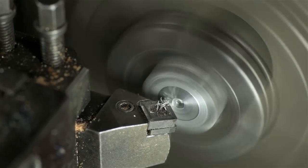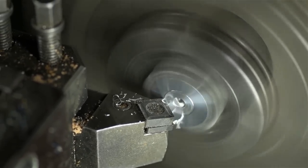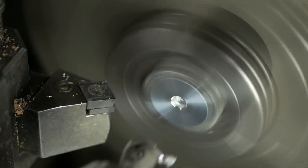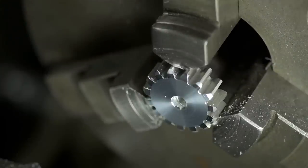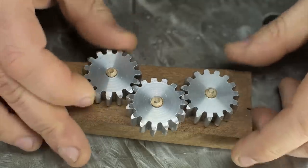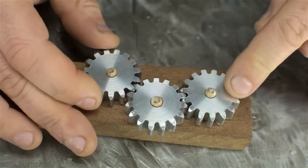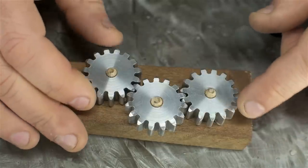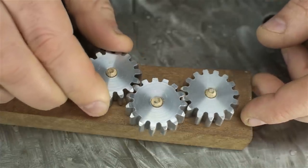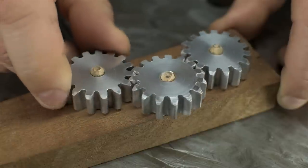You can't always hold a gear like this in a three-jaw chuck. The 100-tooth gears from before were really too thin for that — I had to use soft jaws. If you'd done it right, you'd have had them on a mandrel, and a mandrel you can put into a three-jaw chuck. This gear happens to fit: it's 15-tooth, and 15 is divisible by three jaws. After years of research and development, it's finally here — my three-speed push stick for the bandsaw. I parted off three gears, cleaned up each face, and knocked a small chamfer on the teeth. I never figured out why they chamfer gear teeth — not on all gears, but frequently on machined gears. I do it frankly because I think they look better, and you can charge more for parts that look better. If anyone knows why that's really a thing, please share — it makes sense for sprockets, but gears? I don't know.